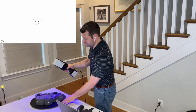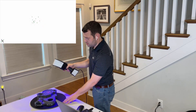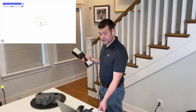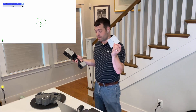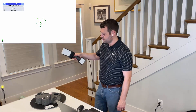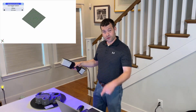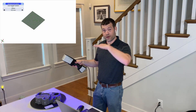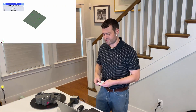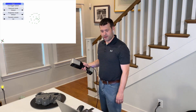The ding may get a little bit annoying for the purposes of this video. That looks good. I'm going to jump to the next part of the procedure — it asks me to define the background plane. A really easy way to do that is to have a couple of cards with some targets already set up on them. I'm going to do another step of capturing where the new targets define this plane or cutoff, and you see on the screen it's going to offset that up by three millimeters. I can adjust that height if I wanted to — if I've got a less flat surface I might need to do that. So I'm going to accept that and jump right into scanning.